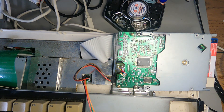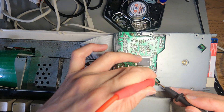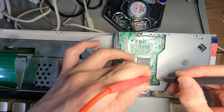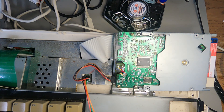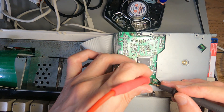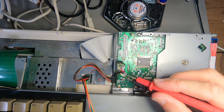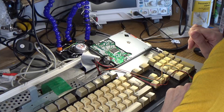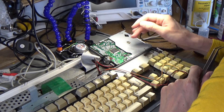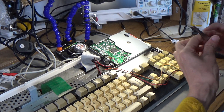There is actually an example diagram - the charge pump's got three capacitors on it, and that's these three capacitors here, and these aren't shorted, so these are all right. This does look like the example diagram. 1A and 1B are pin four and the opposite pin on each side. I don't know what to try - I could just try desoldering these connectors and seeing if this motor itself, just on its own, is all shorted together. So let me boot the soldering iron up and test the motor on its own. If the motor isn't shorted, it can only be that this chip has gone bad. If that's the case, I don't have a replacement.